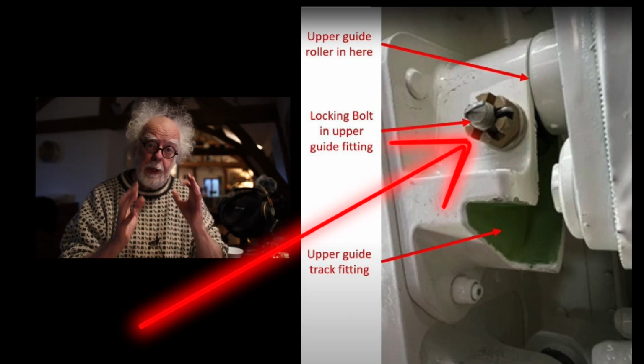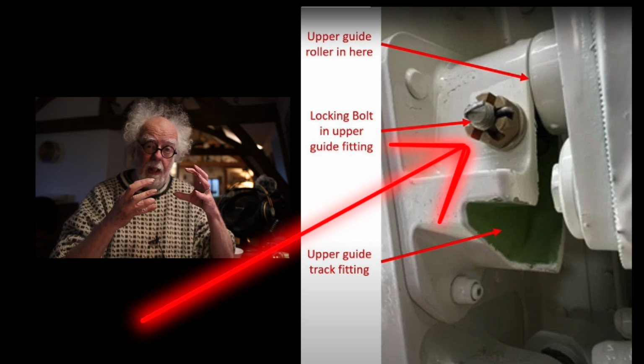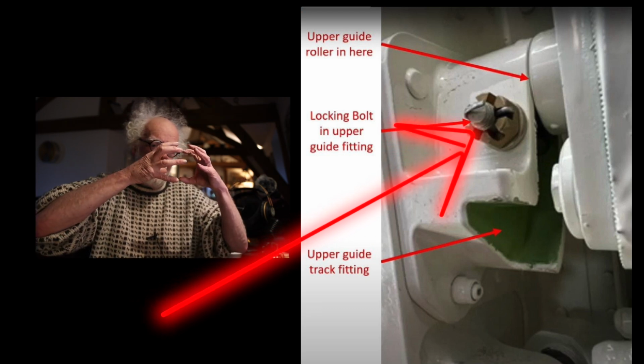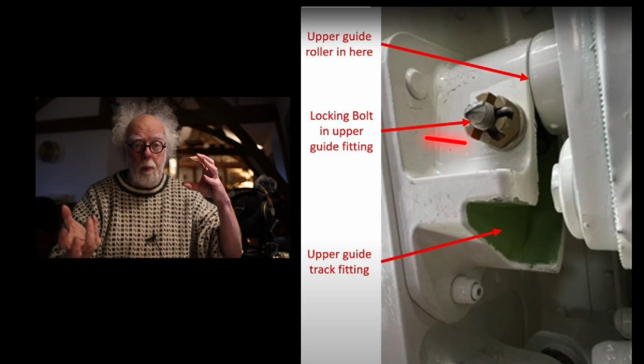There's 2 very possible failure modes caused by the same thing, and that's vibration. When something vibrates, like your car engine or an airplane, the nut tends to unscrew under vibration and pop off. And then the bolt can go plop. Car manufacturers today avoid all fasteners if they can. You spot weld or bond things together. You do not bolt them together with nuts and bolts because they unscrew.